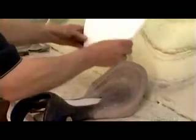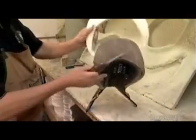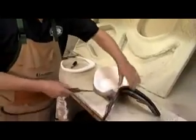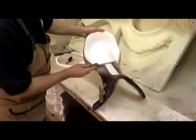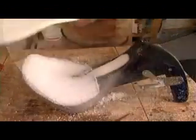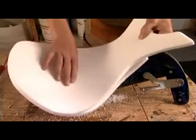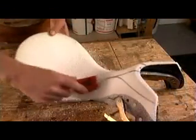Then he sprays glue onto the top of the tree and presses a layer of foam onto it. Using an ordinary kitchen knife, he slices away excess foam at the sides and carves out more foam to shape the seat. Then he shaves the edges with a rasp. Next, he layers 2 more foam pieces over it and sculpts and shaves those layers.